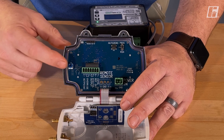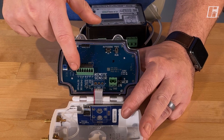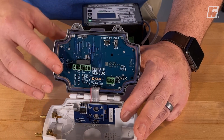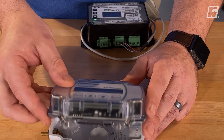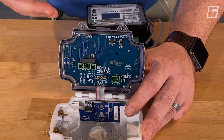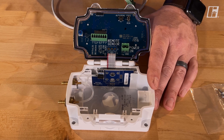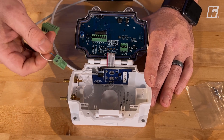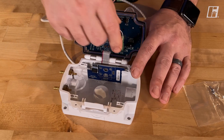Other buttons in here include a contrast potentiometer for the screen. We have our seven terminal pins here and our power here. This whole control is powered off of 24 volts. Typically that 24-volt power is provided by either a Verigreen transformer or a Verigreen HOA control. I have a Verigreen HOA controller here, which allows me to grab the 24 volts and the common, and we'll simply plug those into that port.